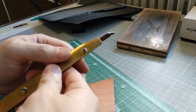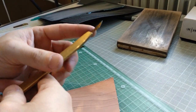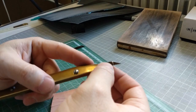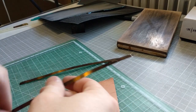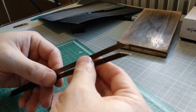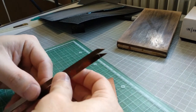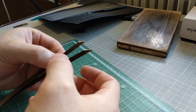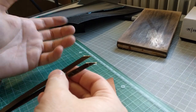So I think it's a different type of steel, because even though it's the same spring steel, there are many different kinds of spring steel, and some are suitable for knives, some are not, and I'm not sure which steel they used for this type of springs. They both looked a bit different, and one looked much more similar to the one in the video. And I think the steel doesn't behave exactly the same as the guy used in the video. Also, maybe the cutting ability has a tendency to get toothy instead of the shiny polished edge I'm normally used to.